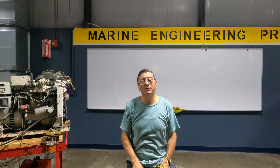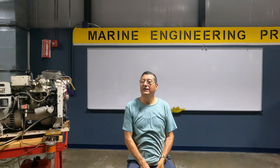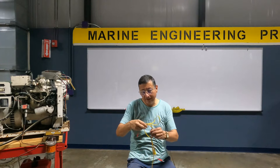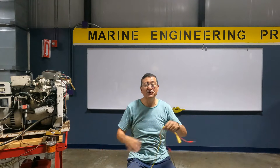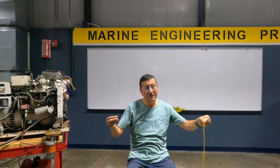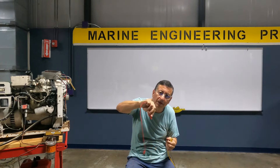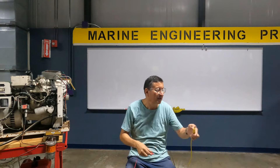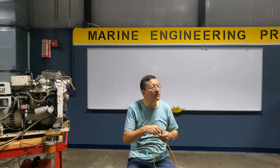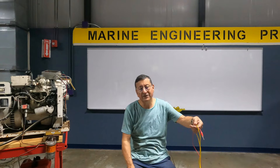In general, producing nothing is not common — that's a no-excitation situation. Important: don't forget that. For that reason, in generator service work, you need to be organized and carry a variety of alligator cables with different clip sizes — small clips for tight spaces and bigger ones when needed — as well as different rolls of extension wires.